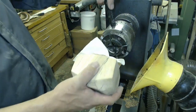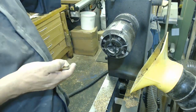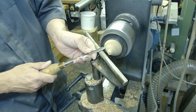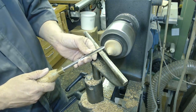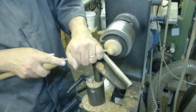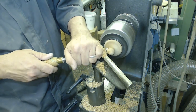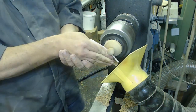That's pretty much the box done now. No finish on it yet but I'll put a bit of wax on it later on. Nice size - it sits in the hand nicely. So here's the core cone that I took out earlier which is going to be the lid - just a very simple little shape, just a little button knob. Just a little round ball on the top so that you can easily get hold of it and remove the lid. Using the spindle gouge because it's end grain turning - turning from the large to the small diameter and just shaping that ball on the top. Didn't take very long to do this part. Just last little shaping there, and finally refining the ball that's going to be the little knob to lift it up.